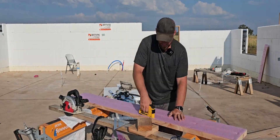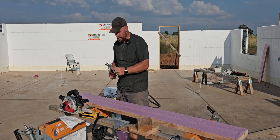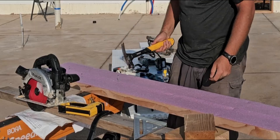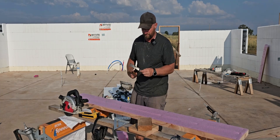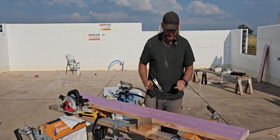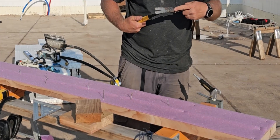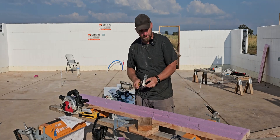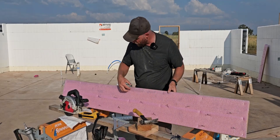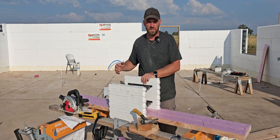Take a hammer and nails and drive them in at random, uneven, different angles — and don't go all the way in. The more weird angles the better. Since concrete is being poured up to the edge of this, what I'm giving the concrete is something to latch onto. It's going to flood around the heads of these nails and hold this door buck in place. I left about a three-inch strip void of nails here because a two-and-a-half inch piece is going to sit on top, and I don't want nails interfering with setting it in.